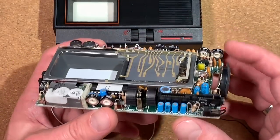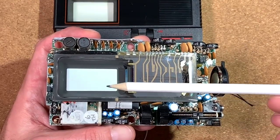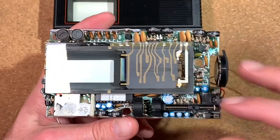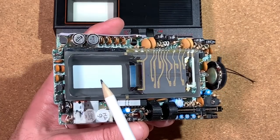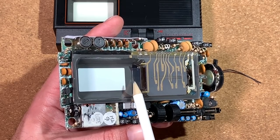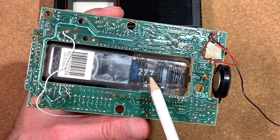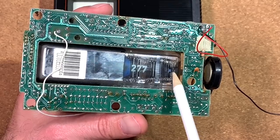Let's have a closer look on the inside. We have this really special CRT — it's made of glass and about one and a half centimeters thick. The very special part is that the electron beam comes from the side and gets deflected onto the phosphor coating. This is not magnetic deflection — this is called electrostatic deflection. Inside we can see two plates for the horizontal deflection, and on the back side two plates for the vertical deflection. Behind those we have some grids, and further back our filament. Very, very interesting.